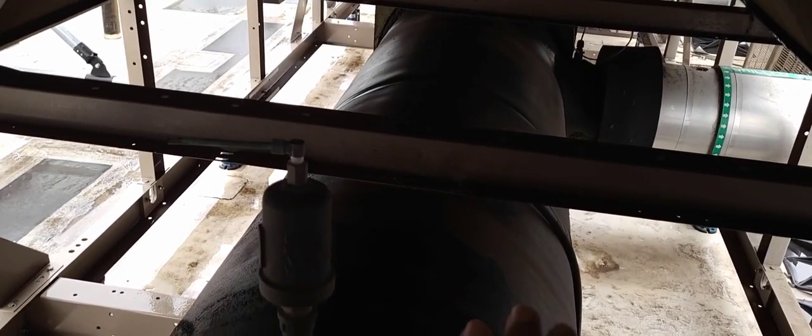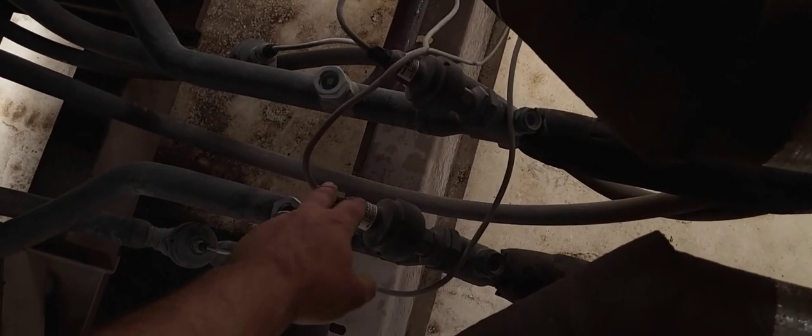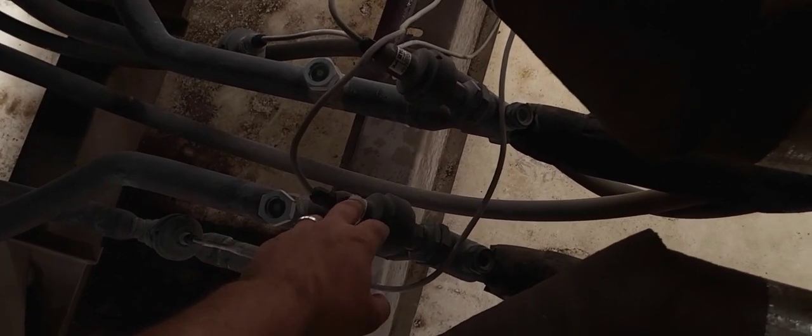If the refrigerant was coming in where the water pipes are and the water pipes were hitting the end bell, then we would know it's a flooded barrel. We come through the drain line into the evaporator, which is basically the final flash point. It's really just allowing the already flashed, low-pressure refrigerant to drain out of the tank. There is some additional pressure drop across this drain valve, but the majority of it happens at the initial flash point at the feeder valve.